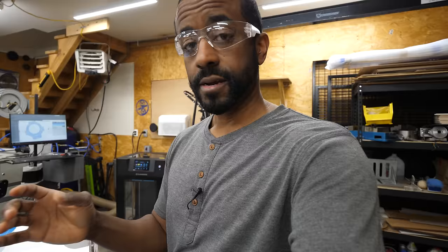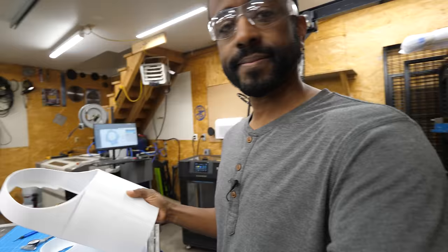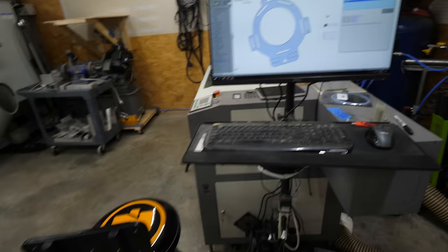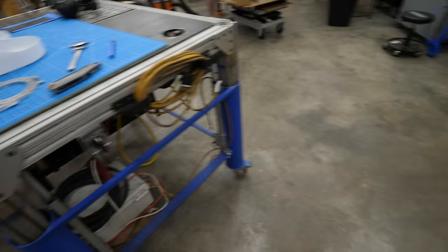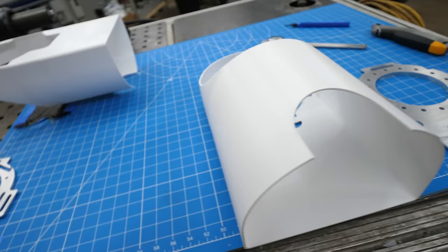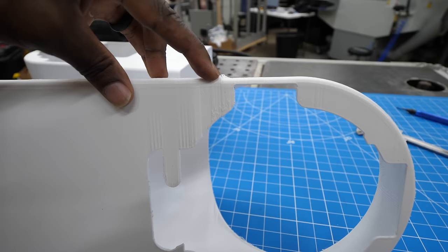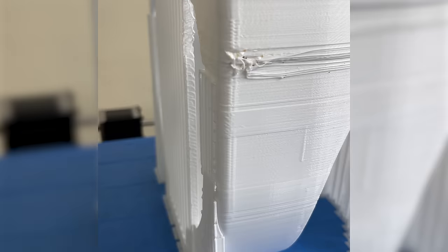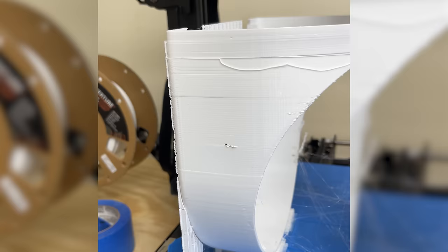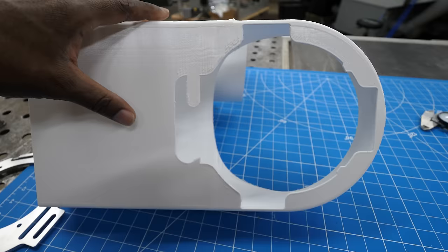I've been trying to figure out why these parts don't fit. Here are the machine parts that I had fabricated — I've been checking all the dimensions against the 3D model, and the parts I ordered are pretty much perfect; most of the numbers are spot on. That made me look at the 3D print. There's a band on the 3D print where it got bunched up, making a whole section a little bit shorter. I even noticed this while it was printing — and this one did the same thing at about the same place.